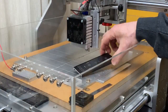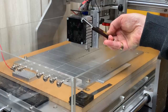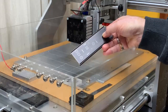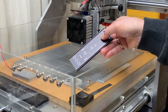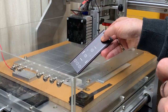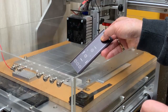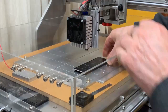So what I'm going to do now is an engraving test. I'm going to use a piece of black anodised aluminium. I find it's the best material to show just how tightly focused the laser is and how accurately I've got everything set up. The thing about using anodised aluminium over wood, timber, paper, cardboard, plastic — any other material — is there is no overburn. So what the laser hits is all that it will mark. It won't mark anything either side of that. So you'll get a really good indication of just how good your focus is and how tight your beam is.